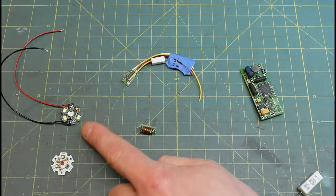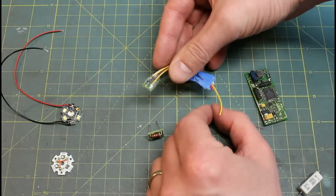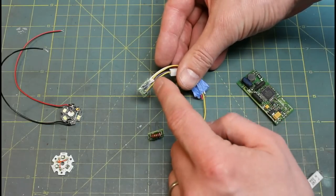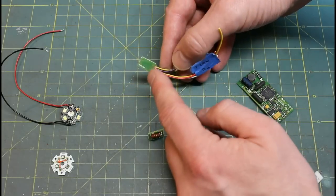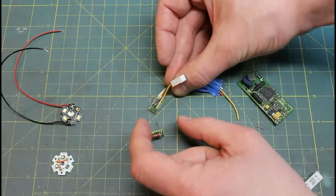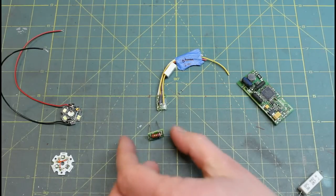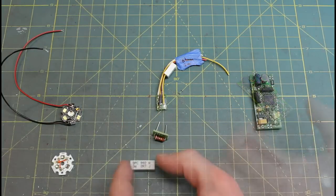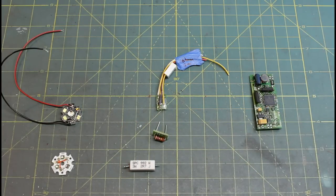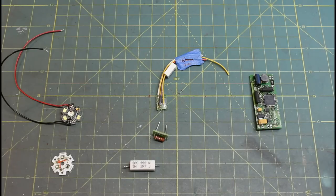Here's an example of a power extender I've already wired up: yellow goes to my flash on clash pad, power positive to positive, negative to negative, then positive and negative to your LED clip. I've got one coat of clear shrink tube wrapped around it so it can sit in the hilt without short circuiting. If you need to find the value of your resistor, you can look up Ohm's law or use one of the LED resistor calculators online — punch in your voltage, the forward voltage of your LED, and your milliamps, and it'll spit out the best resistor choice.